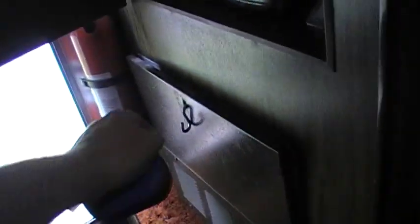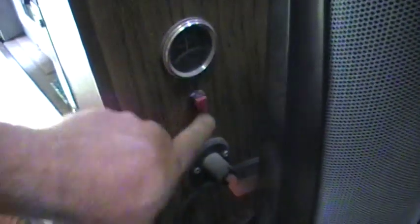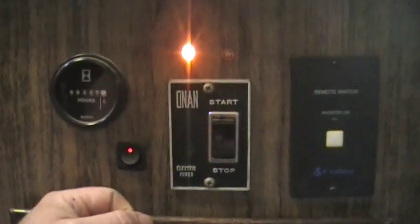I've got the 12-volt converter down here and of course the 110-volt breakers. The 12-volt converter is controlled by a relay, and this push button is on the 12-volt side of that relay circuit. I just turned on the converter — these two blocks are separate. This one is being powered by the converter, this one is only the batteries, and there's a relay that separates them. When the converter turns on and I push the button, the converter turns off and now they're tied together — everything is being run off the batteries. That 12-volt circuit running the relay is part of this master plan.